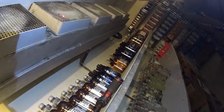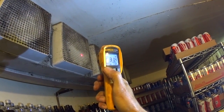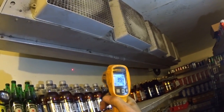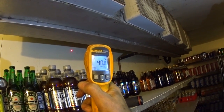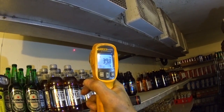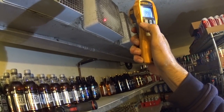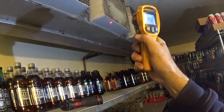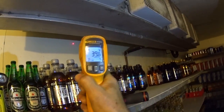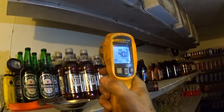The air coming out is 32°F. The air going in back here is 39°F — so I have about an 8 to 9 degree TD, delta T. I'll do that again: I've got 32°F out, giving me about a 7-degree delta T. I'll check it all afterwards.